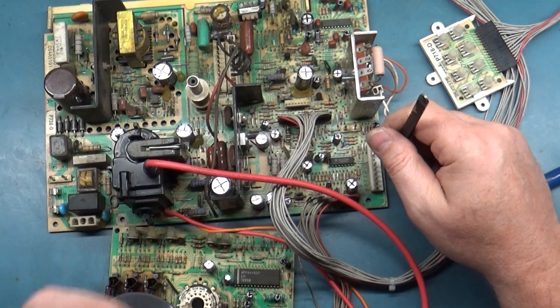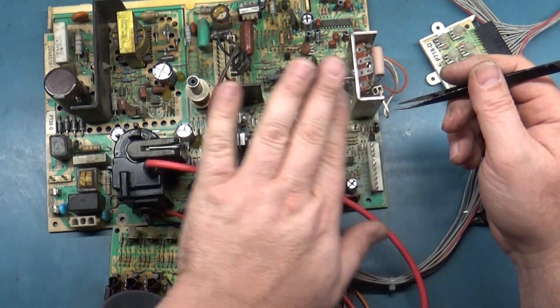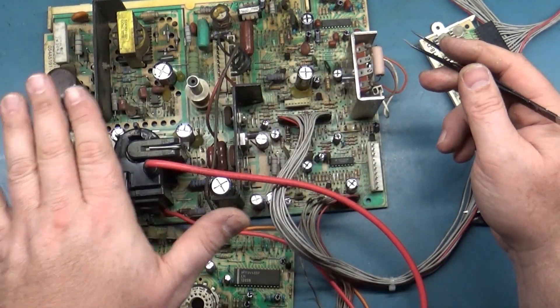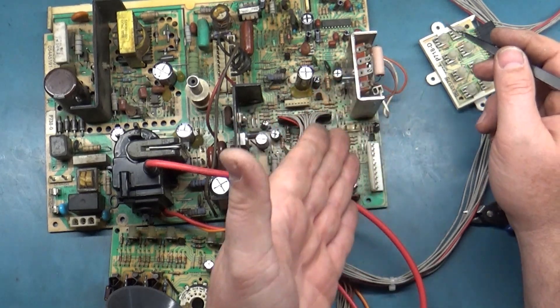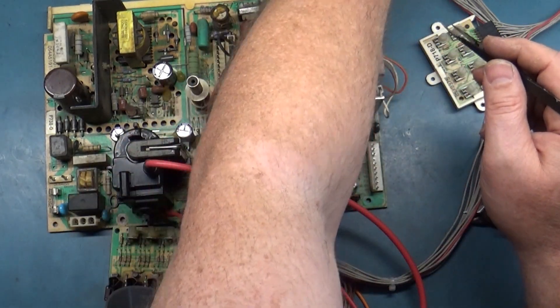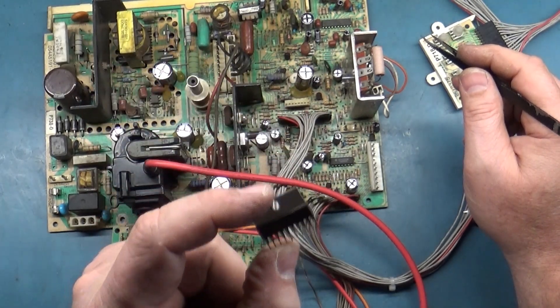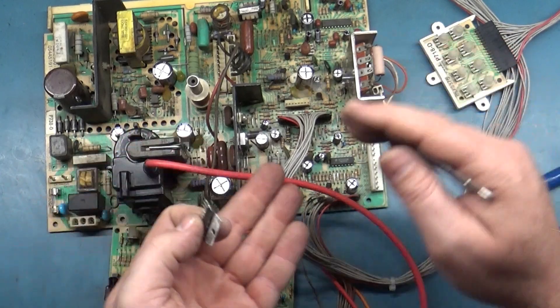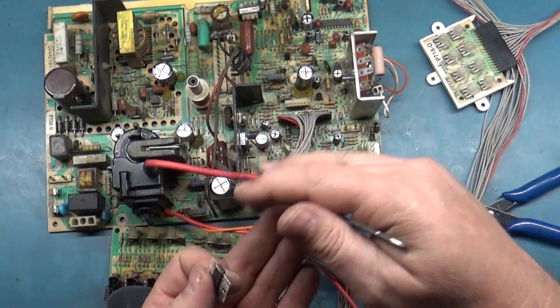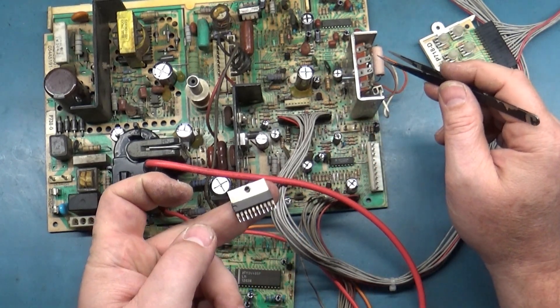Still collapsed. At that point I thought, well, it has to be the vertical IC. There's nothing else it could be — it's not a solder joint problem, not a component problem, not a cap problem, not the flyback. We have our 25-volt reference. So I removed the vertical IC that was on this chassis to begin with, installed a brand new vertical IC, put it on the tube, turned it on — bam. Full deflection, no problem. So this chassis had a bad vertical IC.